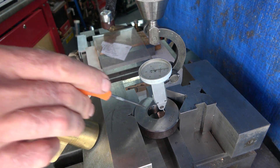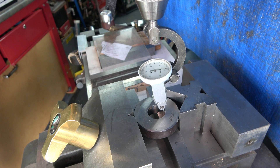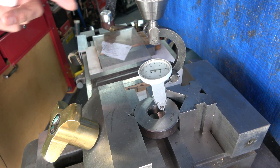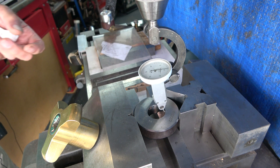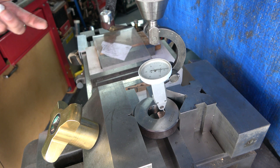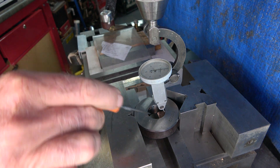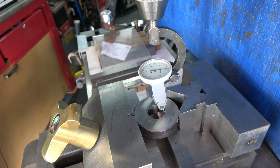Just because you've got this centred up, you've absolutely no idea what position the backlash is on the screws. One might be in the clockwise position, one might be in the anti-clockwise position, or it could be that you've luckily got it to zero and one of the lead screws actually hasn't got any pressure on it. If you were just going to bore a plain hole, no problem — just lock your slides and bore it out. But if you wanted to put pitch circle diameters or bolt holes around this, you must know where your centre point is.